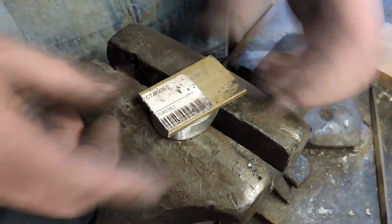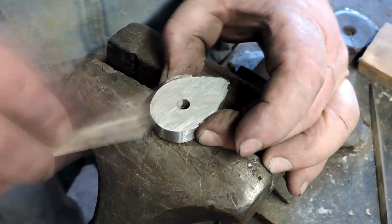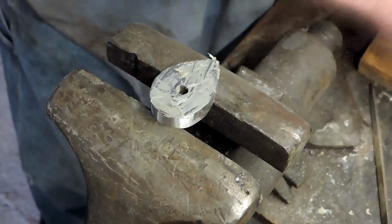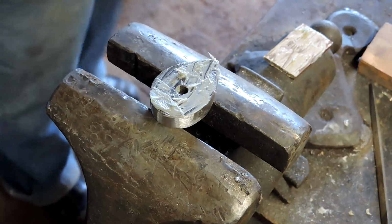All right, so this is a pommel, little butt cap, and I'm going to put this on here. This piece of brass, I'm going to solder it directly to that. Paste flux on both of them, and I'm over fluxing these a little bit. It'll run out, but it'll help that brass adhere to that steel a little bit better.